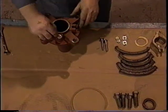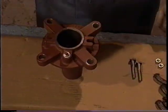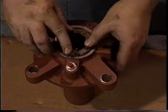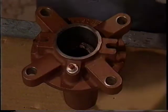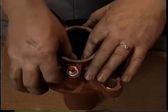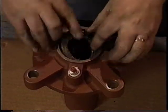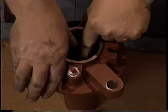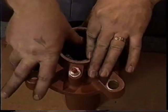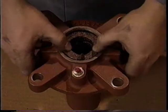Place the cap on the end of the fitting. Place the packing container washer into the hole, then insert the packing rings one by one. It is very important to alternate the positioning of the open end of the packing rings — this will allow the correct amount of water being pumped to travel along the shaft and provide a better lubricating effect. If you are installing the packing rings for the first time, you will only be able to fit five packing rings into the packing container. If this pump is new from the factory, it will have five rings installed and one loose. After a short period of operating the pump, the packing rings will flatten and then the sixth ring can be installed.